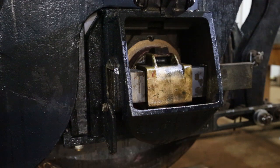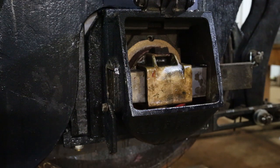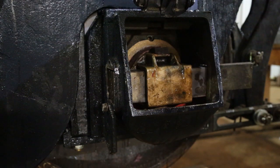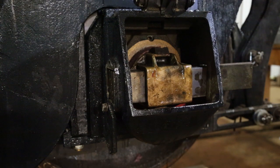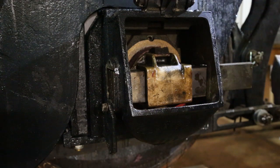We're at the point now where we've got the last two of the nine plates to go in, and they're always fairly hard because we're compressing everything and pushing the box out and the journal in, so it's a lot of pounding with a hammer, which is the next step.